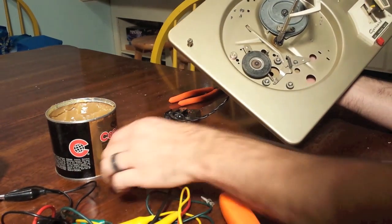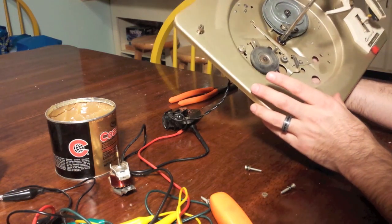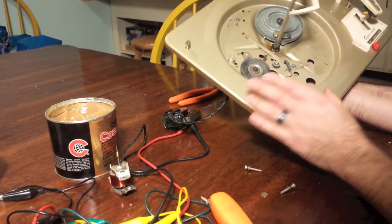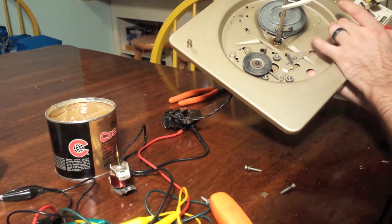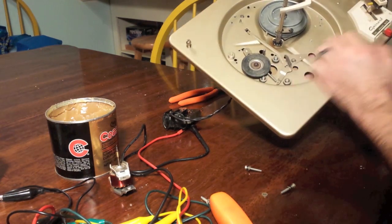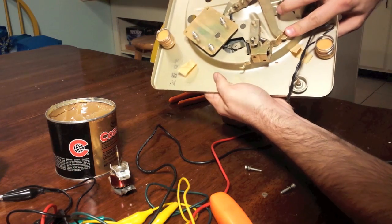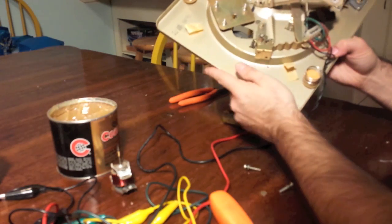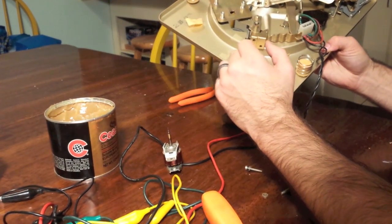The motor spindle comes up right through here, but I've got it removed. There's a spring tension that holds the idler in place as part of the linkage. If I turn it on you can see the linkage works properly — it brings the idler in where the hub would be. That's what the speed selector is doing: it's just raising and lowering the idler to make contact with different sections of the step spindle hub. And I think that's about everything.